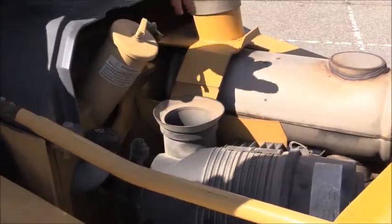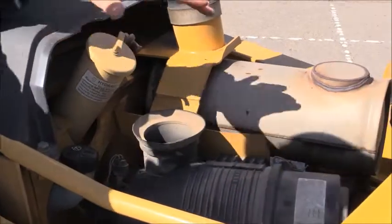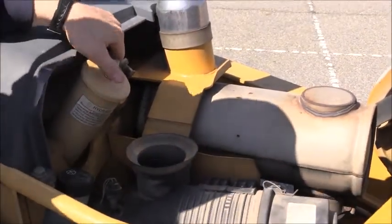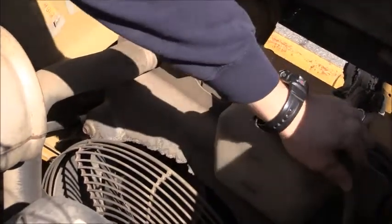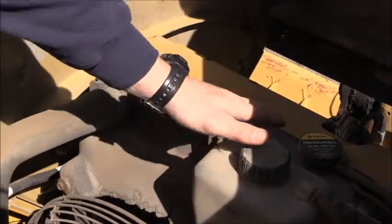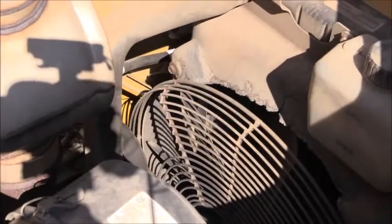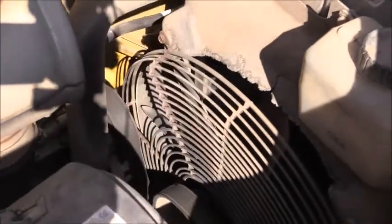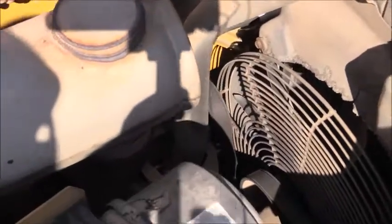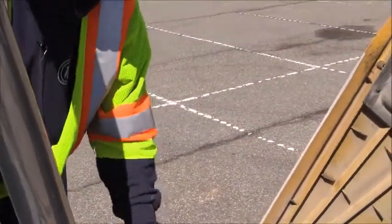As I move to the top, I have my hydraulic — where I fill and check my levels. I also have my windshield washer fluid here. While I'm up here, I'm giving a visual overview, making sure there's nothing lodged in here and looking for any apparent damage or debris. I'm also going to check my coolant level, making sure it's sufficient, and checking the hoses coming to and from for leaks or damage. Also checking my radiator — ensure you do not open it when it's hot because it's pressurized. Checking my fan and fan belts, making sure the blades look in good working order, no debris. I'd also finish checking the rest of my belts on both sides for cracks or excessive dry rot, and checking any remaining hoses and general connectivity points for no apparent damage or missing bolts.